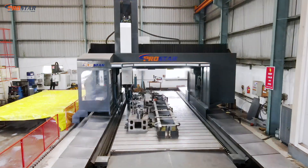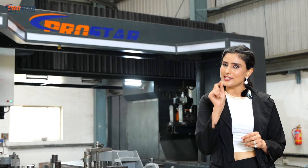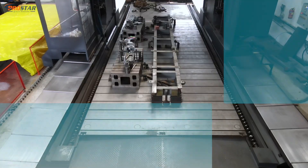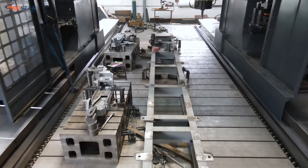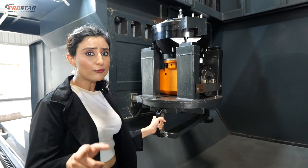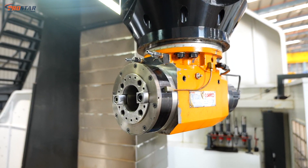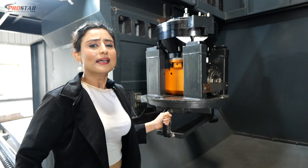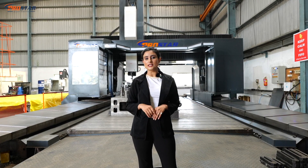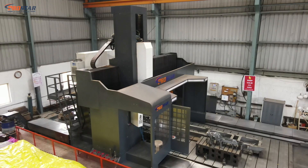This machining center is like a colossal cricket pitch, giving every task a touch of ease — every heavy duty machining job done with ease. It features a fully automatic 90-degree milling head with 5-degree indexing capability for versatility. The X-axis is guided by two servo motors for X1 and X2, giving you backlash-free and precise movement.